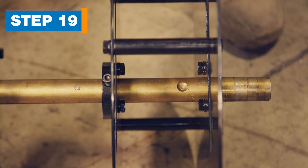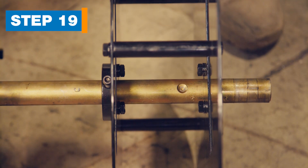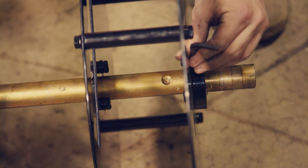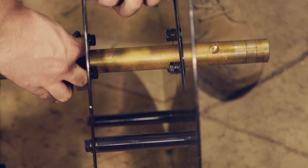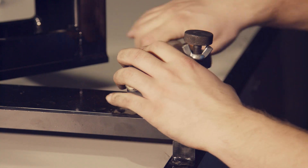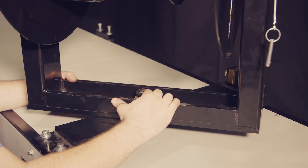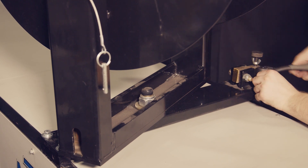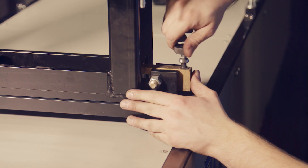Step 19. Move the reel rack to the 5-inch position. If equipped with reels, start by moving the fixed half wheel. The fixed half can be identified by the divots in the shaft. Loosen the allen screws, then move the reel to the divot marked 5 inches, then tighten the screws. Next, loosen the four bolts that attach to the reel rack and slide the assembly to the back side. Then re-tighten the bolts. Secure the turnstile by pushing in the clamp bar, then tightening the hand knob and wing nut.